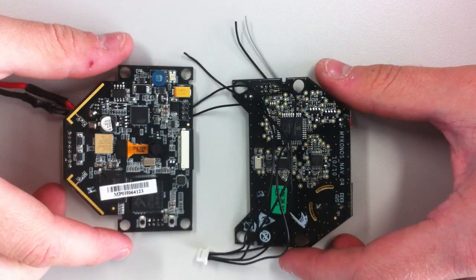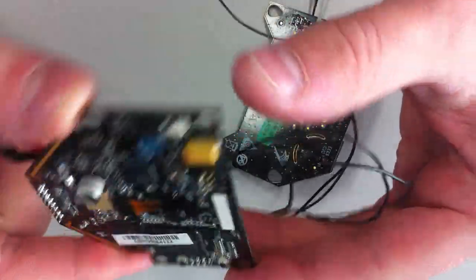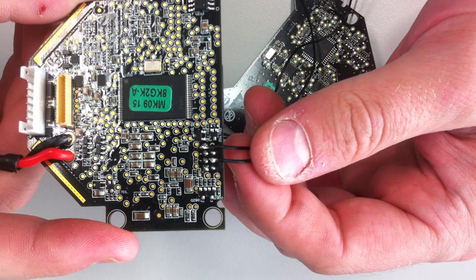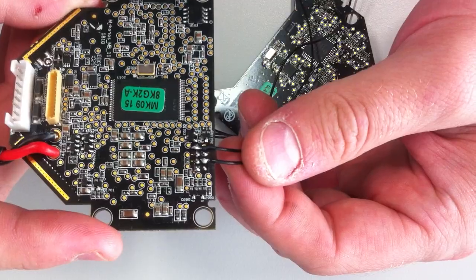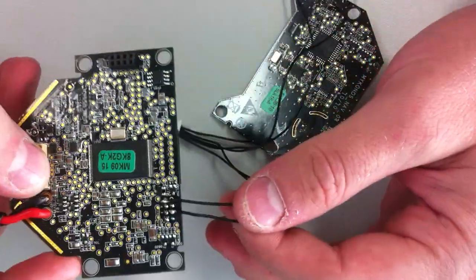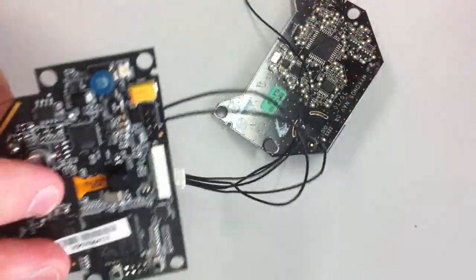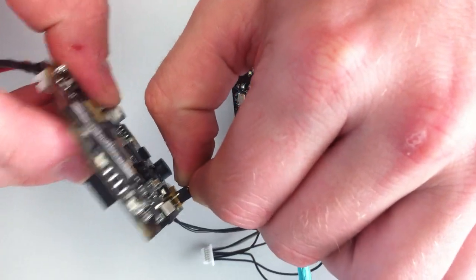This particular board has been modified in the same way as the previous boards, but as you can see I haven't damaged those pins. I've actually soldered to the underside of the board. Parrot uses an epoxy resin to protect the circuit board — I believe for drop protection — though the underside was quite easy to solder to. I've picked up the ground pin and the TX pin on this side, keeping that connector free. And as you can see, the connector for the USB flashing capabilities still works fine.